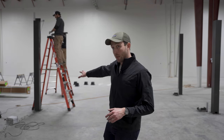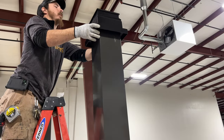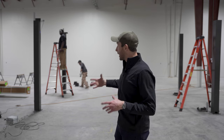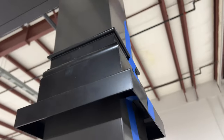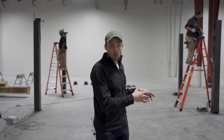This unit doesn't have base trim, which is why the post bases are color matched. If your unit does have base trim, those post bases would be standard stainless steel. Before putting the gutter connectors up, slide the base trim collars down the post and set them at the base. Later when you anchor and plumb, you'll lift the base trim up and tape it halfway up the post while running the anchors, then let it slide back down after. Make sure to add base trim before attaching the gutter connector assembly into the post.